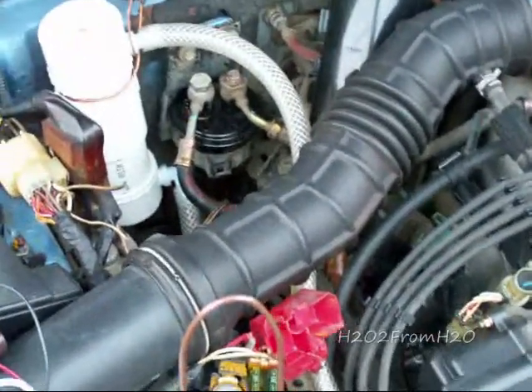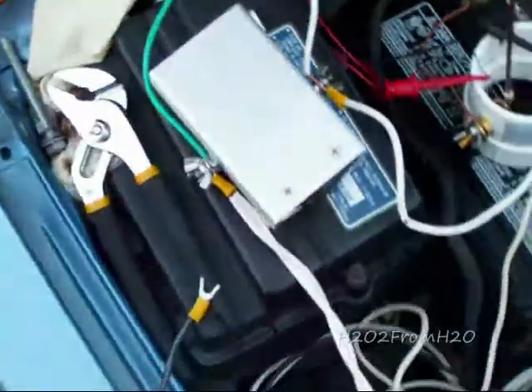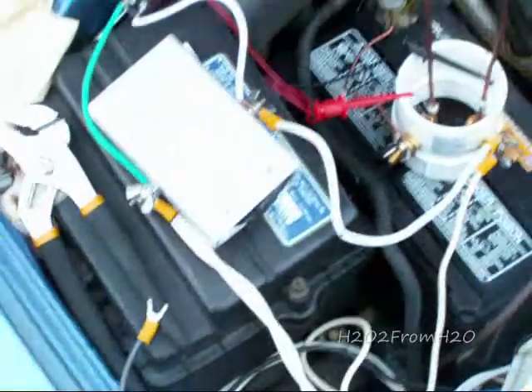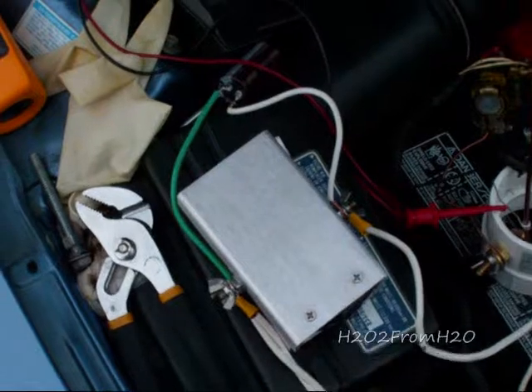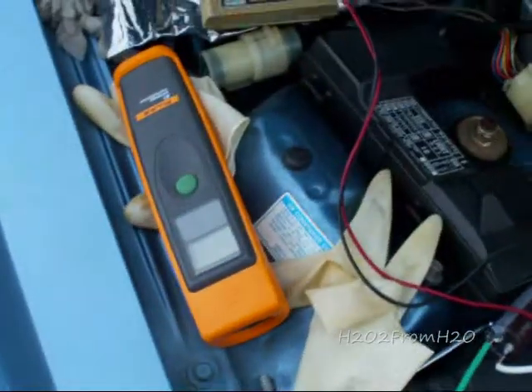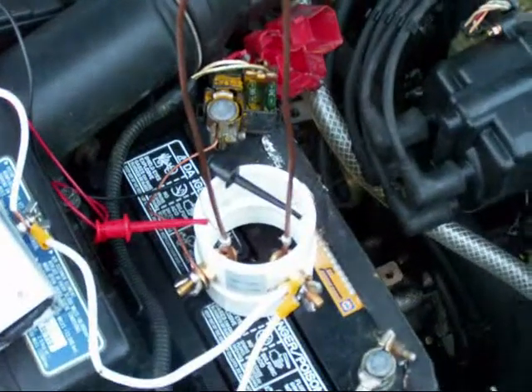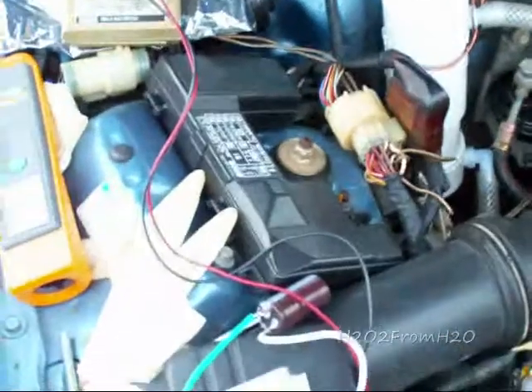It's running at a DC input of about 31 amps. I've got my PWM hooked up, my thermal IR meter, and my PWM shunt is ready to go. The scale for my PWM shunt is 1 millivolt per amp.